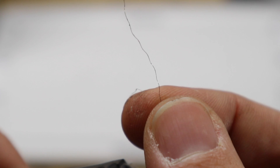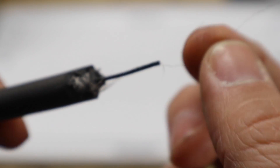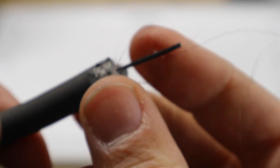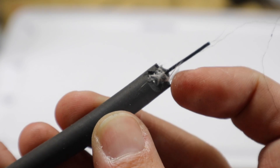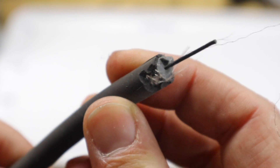I started pulling on the conductive suppression layer and you can actually pull it off of that center core. This is spiral wound, which we'll talk about later. Then you can see the insulation layer — that light gray layer — followed by the fiberglass braid sticking out right there, then surrounded by the silicone outer layer.